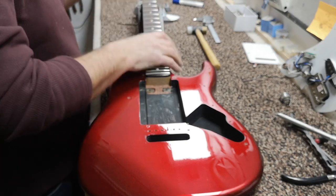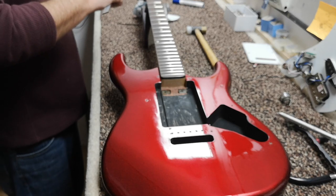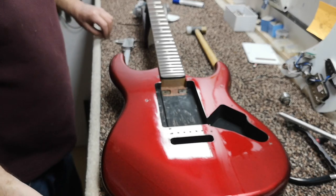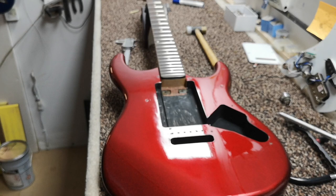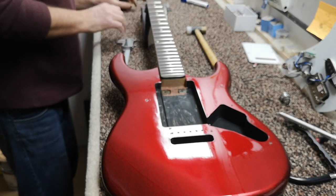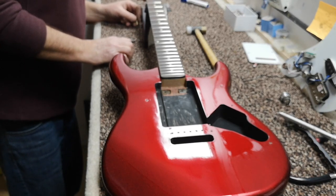Now, what I've got is this plastic nut for reference. Horrible plastic nut, I should say. Let's have a quick look again. So 3.4. But as I say, the slot is about 3.25. So we're about 0.15 or 0.2 of a millimetre short, or too little. And that would cause a horrible amount of lean, and it's just diabolical.